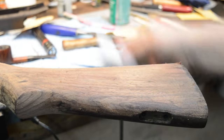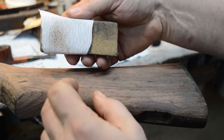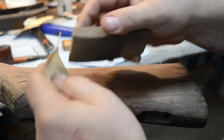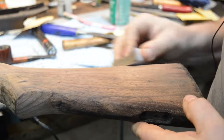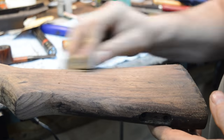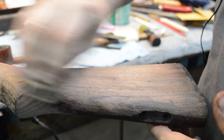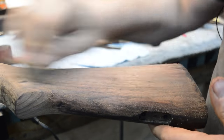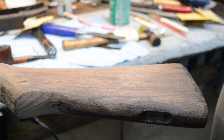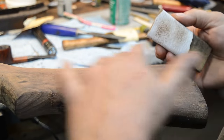And we still have some adherence. I'm going to wipe that on my, see, we've got some oil in here that's making this stick, and we're not going to be able to get below it. But boy, I tell you what, this sure beats the heck out of trying to cut all of this nastiness off of this piece of wood with just sandpaper. And the only way to really get it off the wood with sandpaper is to start in the 40 to 60 grit range and just, you know, gnarl it all off.